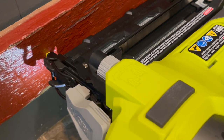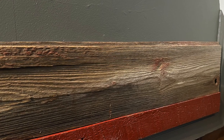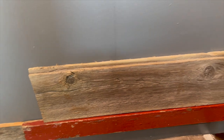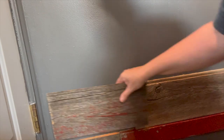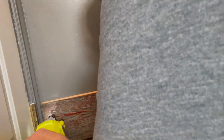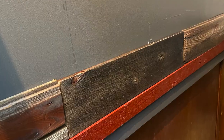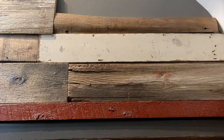I started at the bottom — you put your board on, make sure it's level, and then you're going to nail right in to where you marked the studs. Continue adding boards. It's that simple, except it's not really. I decided to use different widths and different sizes, so it really took a few trials and errors to get the right boards in the right place. If you're doing this project, it might be a good idea to consider the size of your boards. If they're all the same size and width, the project will go a lot quicker.